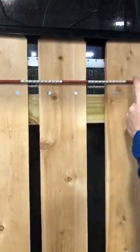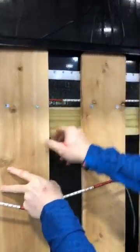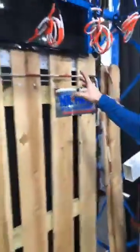And do you have different ones for different picket widths or different spacing? So this same one will work for a 3 inch, 4 inch, 5 inch, 6 inch picket. You just have to cover the red. So the one in the back is the one we're using. All we're worried about is covering the red. We're not worried about the whole space. We're worried about the edge of it. Right side, same side. So we start on the same side. We're all going to work on the right side. Awesome. You can imagine doing shadow box without that.